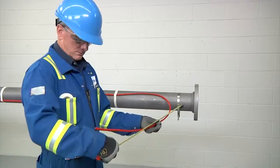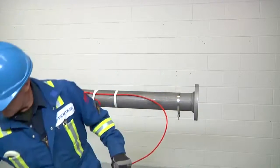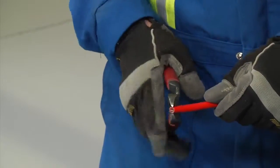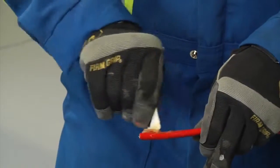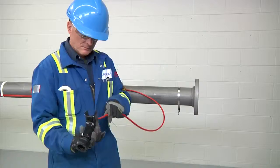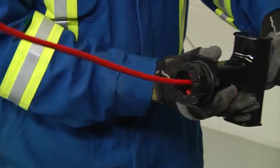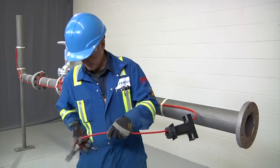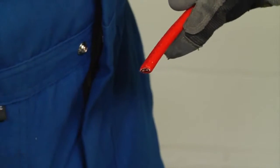Allow 24 inches (600 millimeters) of heating cable for installation. Cut off the heating cable end at about 45 degrees. Apply lubricant for easier insertion into the stand. Insert 18 inches (450 millimeters) of heating cable through the stand. Square off the cable end with a 90 degree cut, but do not attach the stand to the pipe yet.